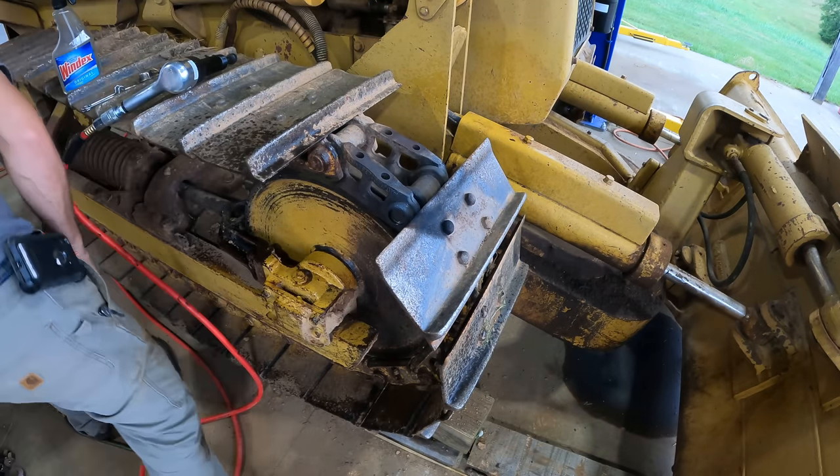This thing I can lift — it's not that heavy — but man if it were to fall and hit you on the head when you weren't ready. Thinking about this pin — I came at it with that air hammer thinking it was going to make it easier, but what I did is rather than using a big enough sledgehammer and hitting it very hard, which makes the pin move, if you hit it a bunch of times softer you just mushroom it out. Once you've mushroomed it out, now it's going to be even harder to get through there — it's too big. Coming at it with an air hammer and a sledge that's too small is not only not going to work, it's going to make the job that much harder. Lesson learned.